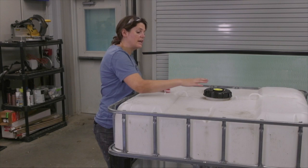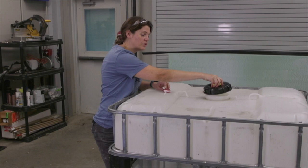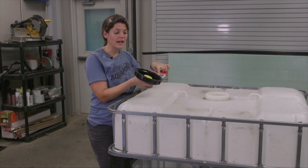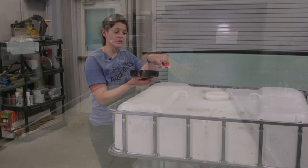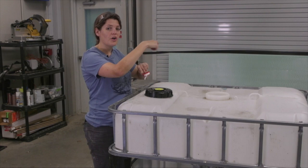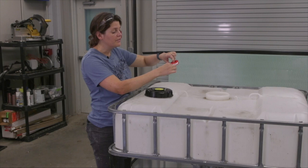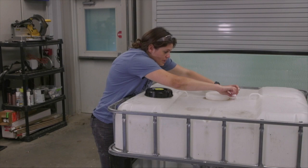The next thing we're going to do is seal the cap to our tote. This is actually the bottom of our tote — we've flipped it over to have some room to work. The cap just screws on, so I'm going to put some thread tape and then a little bit of silicone inside of the threads of this cap so it has a nice tight seal. This is called plumber's tape — when you put it on, you want it to go in the direction that you're tightening, which in this case is clockwise. If you do it the other way, it'll unthread itself and not get a nice seal.